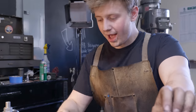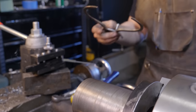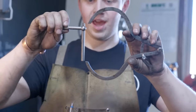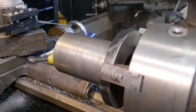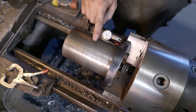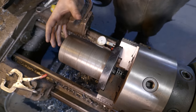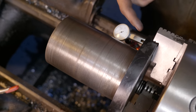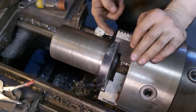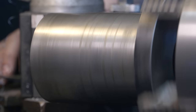Here's where we're at. I don't have a great way to measure how round this is — I have to use calipers and an inside measuring micrometer to measure out the spacing. I'm fairly certain it's a little bit out of round because it didn't get sat in the same place for a long time. There is wear along this piece; it's thicker in the center than it is on either side. I've got it squared up now where we're within a thousandth of an inch of having this true, and I want to take off as little material as possible to give us a little bit more room to work with for our bronze material.